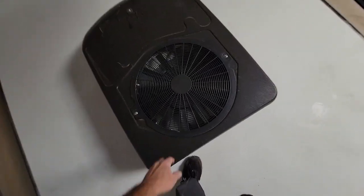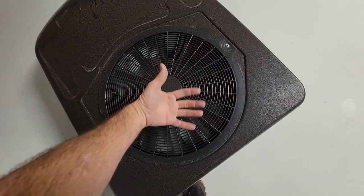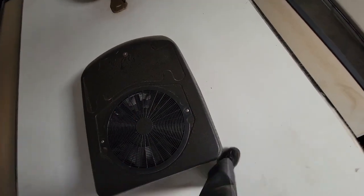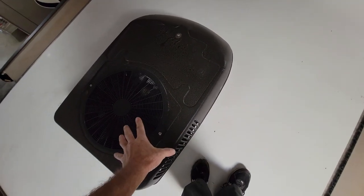The biggest issues on these ACs is that the outside blower and the inside blower share the same motor, and the inside impeller on that blower wheel usually falls down — either jams up or explodes. That's why I think Coleman RVP went ahead and discontinued this style.